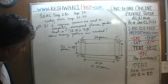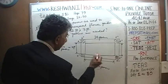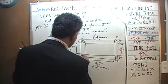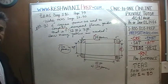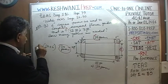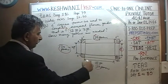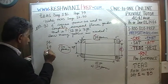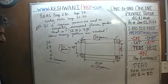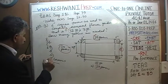There we go, we are done. All we have to do now is add up all the figures. We need 24 on this side, 24 on this side, 6 pavers on this short side, 6 pavers on that short side, and don't forget the 4 corner pavers — 1, 2, 3, and 4. So: 24 plus 24 plus 6 plus 6 plus 4. Six plus 4 is 10, 6 plus 4 is 10, 10 plus 10 is 20, 20 plus 24 is... that gives us 64 pavers.